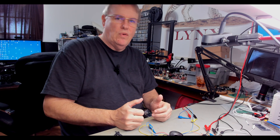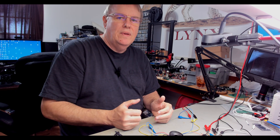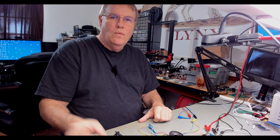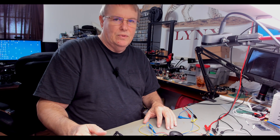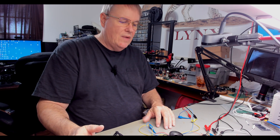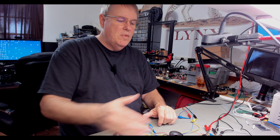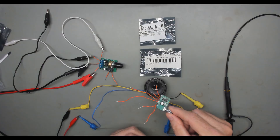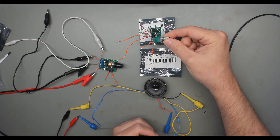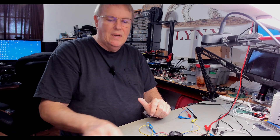I wanted to compare the amplification of both and compare the harmonic distortion to see which one looked best. I'm doing this for our shootout — if you've been following my channel, you know we've built a couple of shortwave radio receivers and I'm going to build another one. I needed an audio amp, and I found this little jewel, the PAM8403, is not working correctly — I've got a bad one. It happens, especially from AliExpress where you're paying a dollar or two for these things.